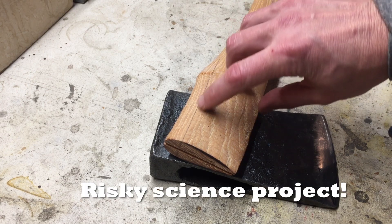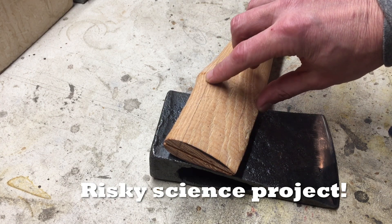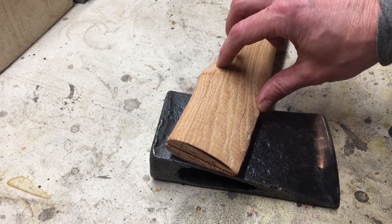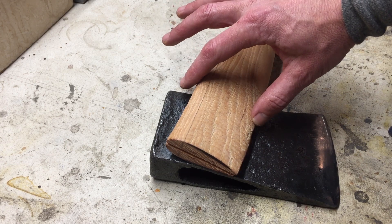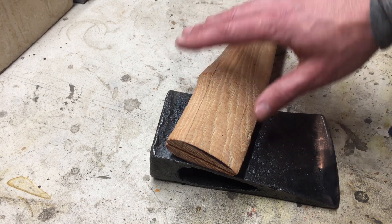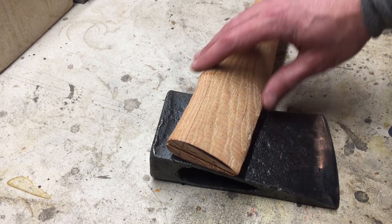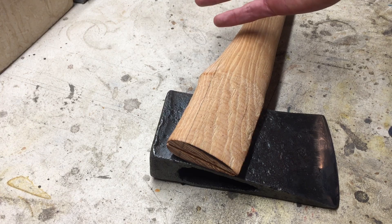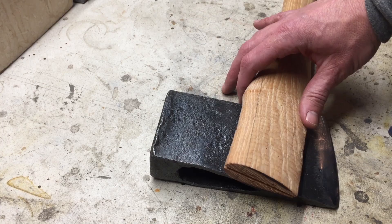But there's another way to do it, and I know it's possible — I've seen it done. You actually cut off the back of the eye wood, make it flush, then glue a complete piece of wood under the whole area. Wood glue is really strong; this is a legitimate way to do it. You basically make a new eye, shape it, fit it to the head, and go from there.